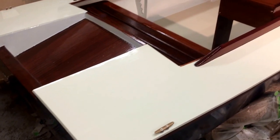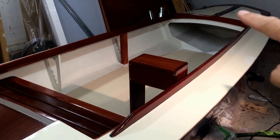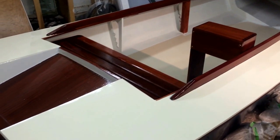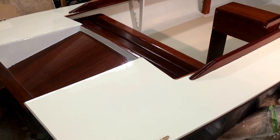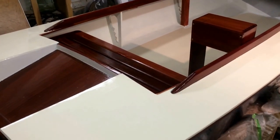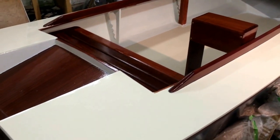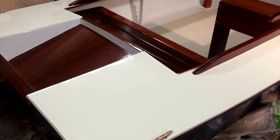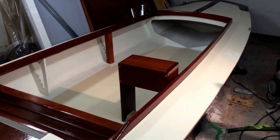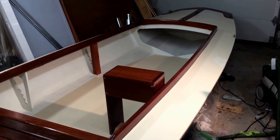This is 16 foot on the nose. I'd originally planned on bright finishing the top decks, which I did not. A big lesson learned there — the wood dye I've been using to color the mahogany and the mahogany plywood comprising the deck either did not fully dry or reacted with the epoxy resin, creating a lack of adhesion in some areas of the fiberglass. That created some patchwork I had to fix up and it really would not look good as a bright finished surface. So I painted the boat instead.